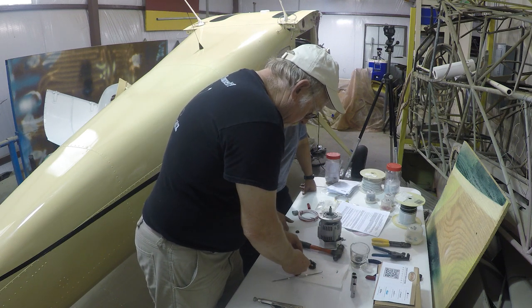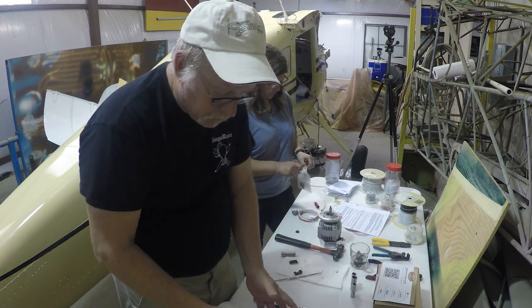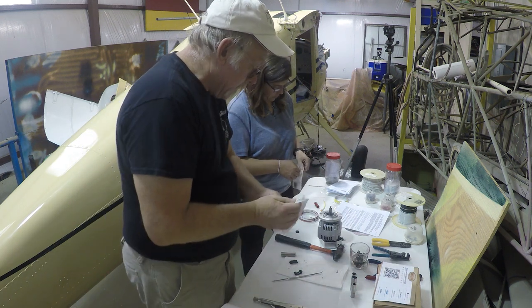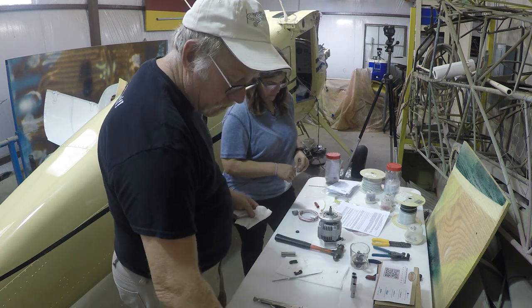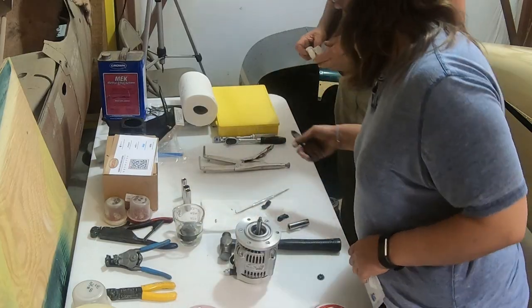Yeah. And these are the rubbers. Now pull those other rubbers out. Little shock absorber. What they're for is for starting and stopping, and then dampening the piston or combustion input pulses to the generator.